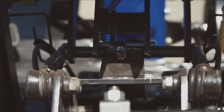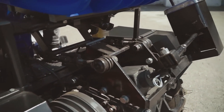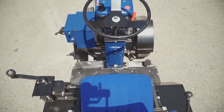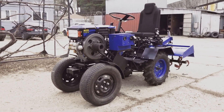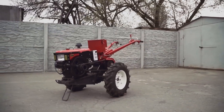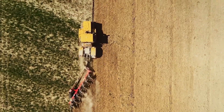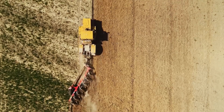The lifting mechanism has three positions: the upper one is for maneuvers and movement, fixed for transporting the trailer, and floating for working. The gear unit is secured with a spacer bolt during transport. The seat is plastic and hard; the steering wheel is metal, simple and reliable. The buyer can replace these units with more advanced ones — and to remind you, this is the same power tiller, only on four wheels. Like a power tiller, this equipment is not intended for industrial use, so for the average private household and short-term work, these units are convenient and practical.